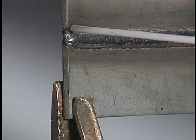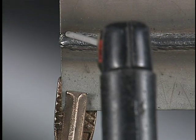For the third weld, center the electrode on the upper toe of the second bead with a work angle of 5 to 10 degrees below horizontal and the same 5 to 10 degree drag travel angle. The top toe of the third pass should eat into the top edge of the joint by about 1/16 of an inch.